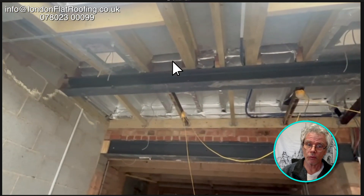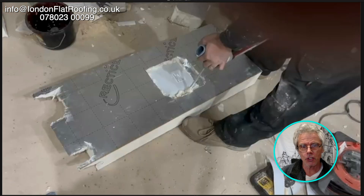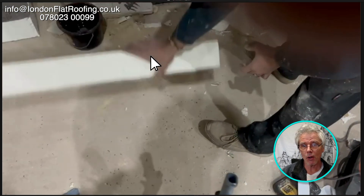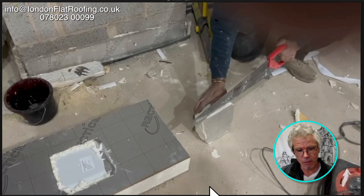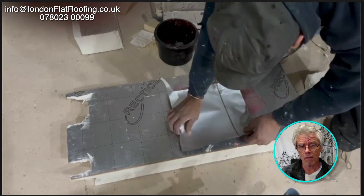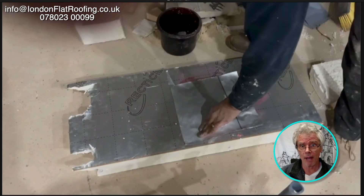On this cold pitched roof the problem he's going to have is his ventilation across the top. He's stopped air movement through that particular part. Here's a fantastic detail - they've cut out the light fitting box and they're foaming it all in around the outside. They're then going to cut insulation from this slab to fit over the top. The cost of doing all this - if it had been designed correctly in the first place they wouldn't have needed to. There's a thin thermal element, about 15mm, going over the top, but it's made as airtight as possible.